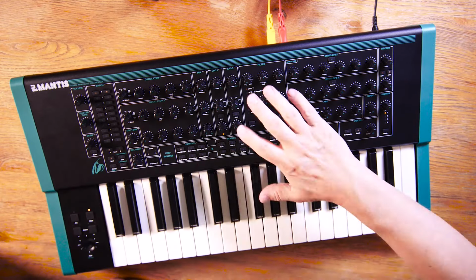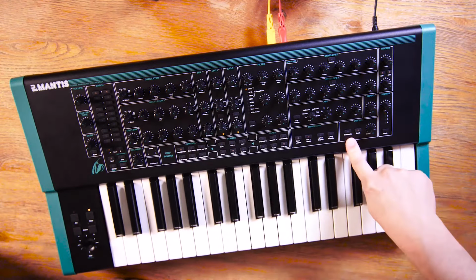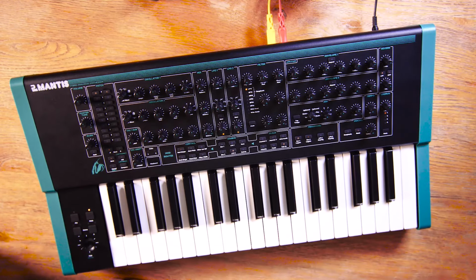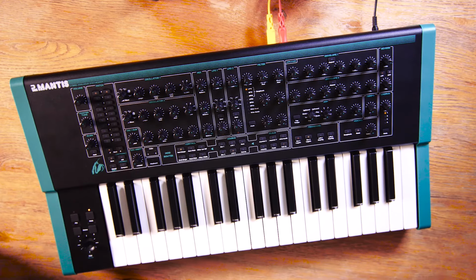That was the idea that I had, that you could take oscillator 1 and oscillator 2 and have 2 notes go to each, but then times 2 because of the duophonic voicing. So we went down that route for a while, and at Superbooth we were still using the word quad paraphonic, which is controversial anyway. When we finally came to it and we'd done all the optimizing of the code, if you could imagine the logic of figuring out what voice goes where and what note is played by what oscillator, that proved a more difficult logic problem than we thought, and we had more processor headroom than we thought. So in the end, we just made it a true 4 voice.